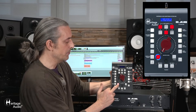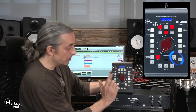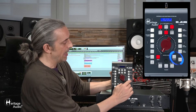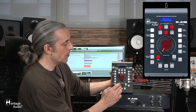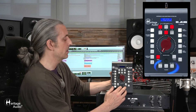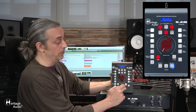You've also got the option to mute it completely, to dim it a little bit, or flip the phase. This Shift button here allows us to access all of the different soft functions written on the side. We also have a talkback mic installed — you can raise and lower the gain on that. It is momentary, so as you hold the button, the talent will hear you, and upon releasing it, it gets cut off automatically.